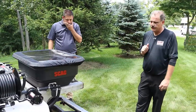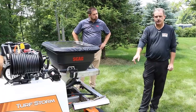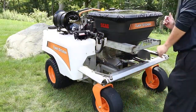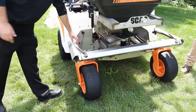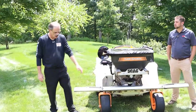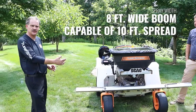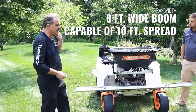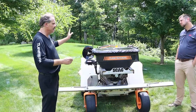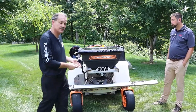With our three valves, on the front boom we have three different spray mechanisms. At each tip, all three work together off that center valve. We also have extension booms — I can pull an extension boom out on one side or both sides. We pick up an extra tip on each extension, giving us an 8-foot-wide boom capable of a 10-foot spray area. There's also adjustability: each tip can be swapped out independently, so you could theoretically have a different setup if that suited your needs — very unique in a competitive field.